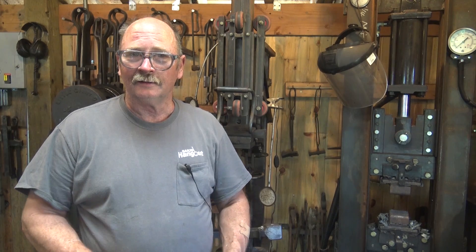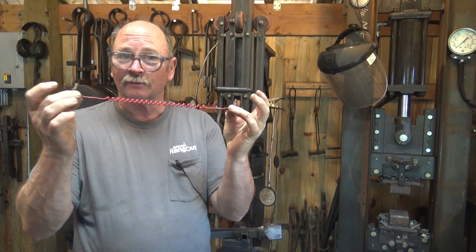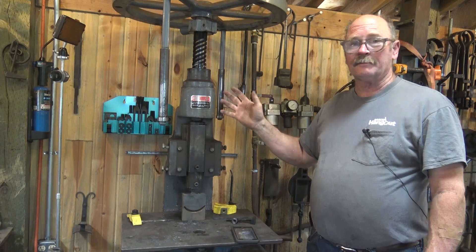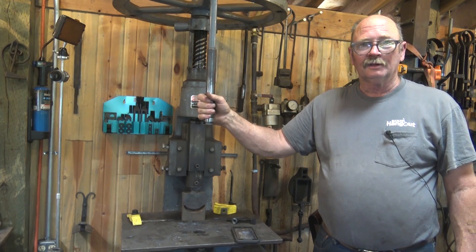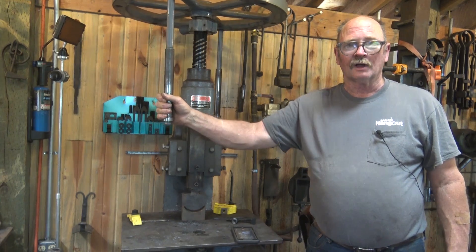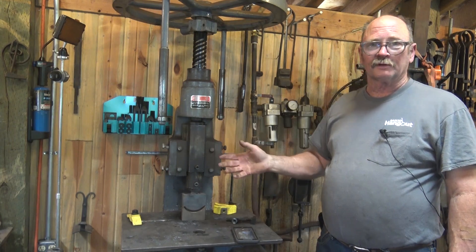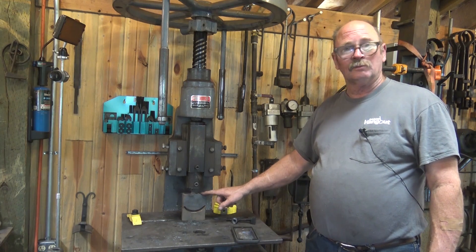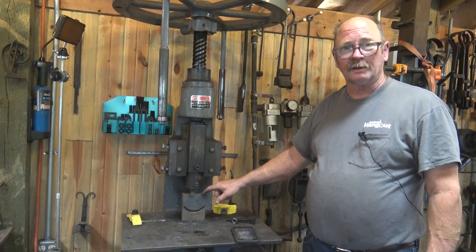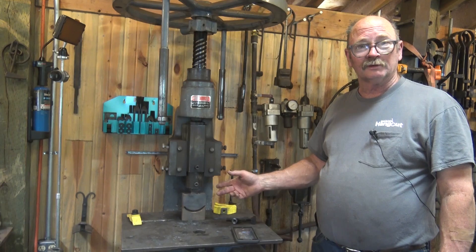I hope you guys heard some of that. I bought this really nice new mic system, but oddly it doesn't seem to work very well — I forget to plug the receiver into the camera. I think that better tool is going to be the fly press. It's quick, it has a lot of force, it wants to go down on its own so there's not as much muscle power needed to do that much work under the fly press. But if it doesn't work perfectly, I can still go back to the treadle hammer. The trouble is, I don't have a die that will do my 11/16th round shank for the fly press. So the first thing we need to do is make a die for the fly press. And to do that, we'll do most of it under the hydraulic press. Welcome back to Black Bear Forge.